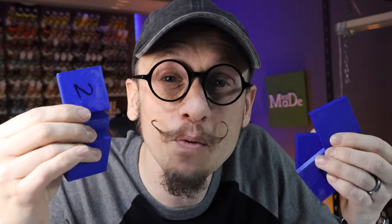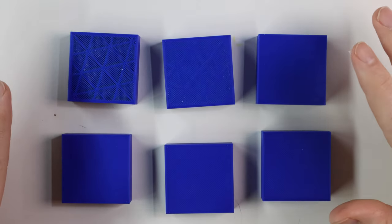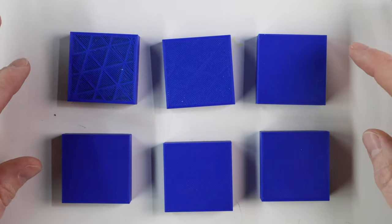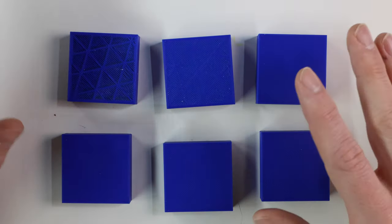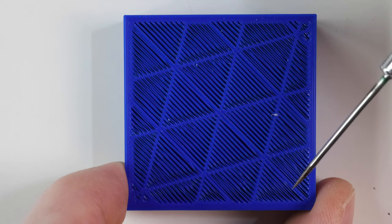Now when it comes to our top layer thickness, it's important to actually see the differences when you only have a few top layers versus a lot more. I went ahead and printed out examples to show what it looks like to have one layer versus six. We're going to look at all the different thicknesses so you can have a better understanding of how it affects your 3D prints. I've got examples showing what our different top layer settings look like — going from one top layer to two, three, four, five, and six.